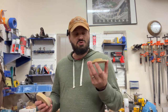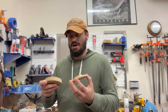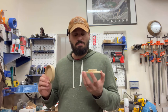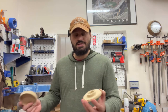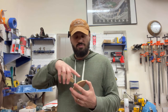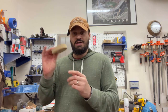In versions one and two made of MDF, I used a quarter-inch downcut bit and also a one-eighth bit to get the lip around the lid. After a bit of time in production, I wanted to reduce bit changes down to just one bit. So on my fourth version I went back to the drawing board and was able to get rid of the one-eighth bit, making the toolpath a little easier to cut out the lip. Now I can run the lid and the base in one fell swoop with one bit.